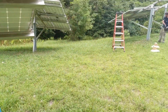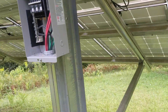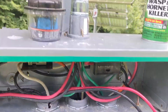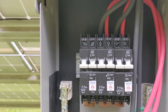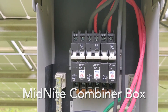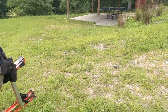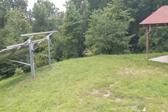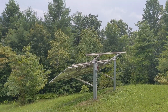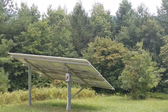On the southwest array we have two strings of six combining with one string of six from the south array. We've got a split for the two MPPT channels, represented by two power distribution blocks. Because there are more than two strings per MPPT, we used the 300-volt Midnight breakers to bring them down — giving us a balanced system between south/southwest and south/southeast. We had some serious failures here — a lightning strike blew out the well pump, the propane line, and took out some panels, which we've never seen before. We're replacing the missing panels on the southeastern array.